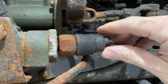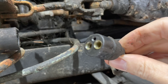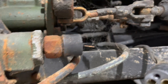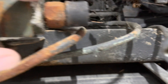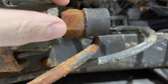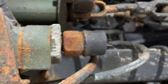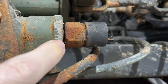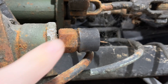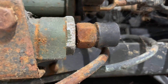Let's see if we can get this wire unplugged. There we go — connection looks clean. Looks like somebody put a little dielectric grease on there the last time they put it together. Pretty sure that was me. So now we can see our sensor here. It's fairly rusty, but hopefully down in the adapter it's not too bad — hopefully they put it in with Teflon tape, which would keep it from seizing to the back of our air pack. The adapter looks like it's been worked on before with a pipe wrench — you can see some teeth marks in there. Somebody probably tried to take out the stoplight switch and the adapter spun with it. So we may want to back that up with a wrench if the switch starts wanting to come out.